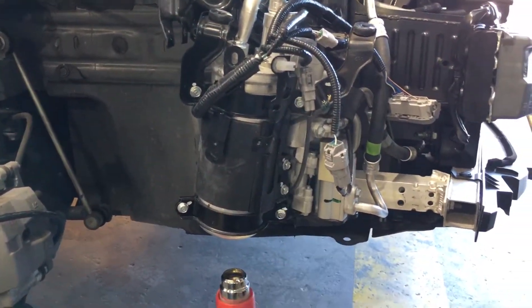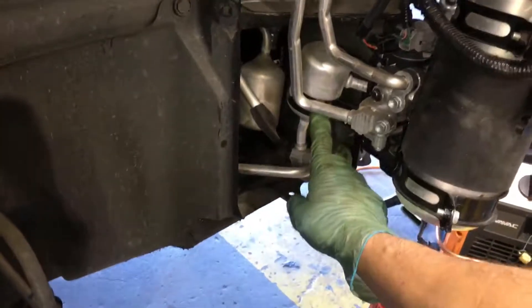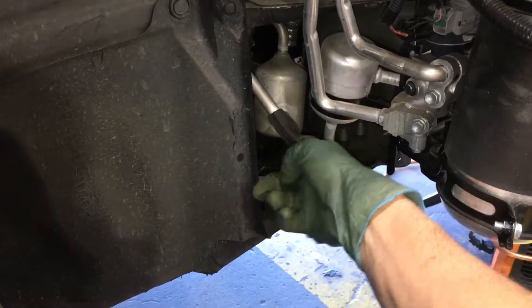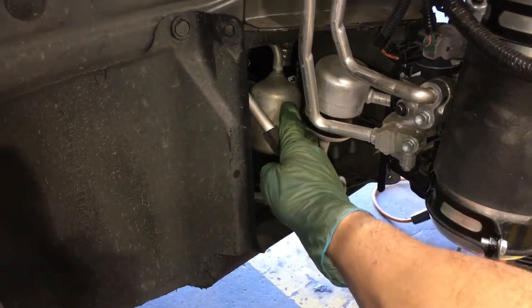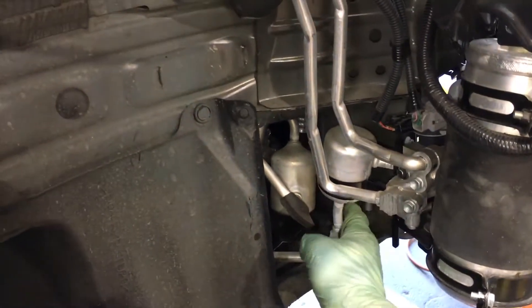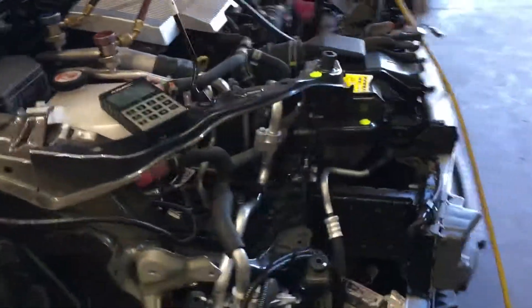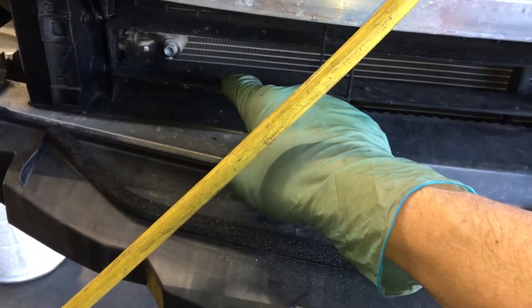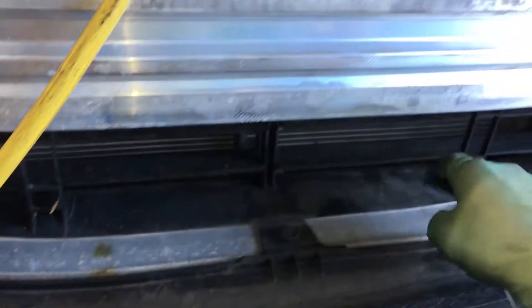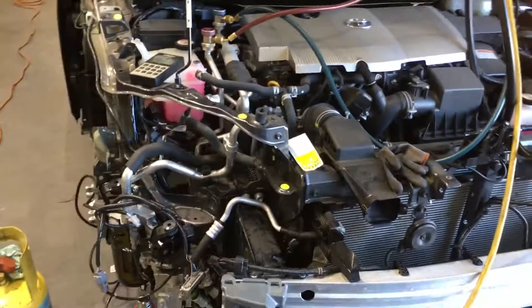And it's not the only thing that holds refrigerant. These lines got all cold because they accumulate liquid refrigerant on the bottom — and that would be buried behind it. This gets cold. The whole compressor got all nice and icy cold at the bottom. This bottom line right here got cold. The whole bottom area of the sub-cooling part in the last five or six rows of the condenser got icy cold because there's liquid refrigerant stored in there. Your evaporator gets cold too. This is in a cold shop on a cold day with no heat.